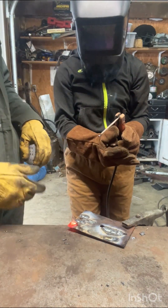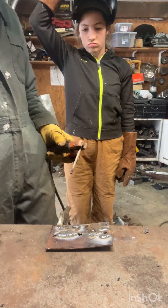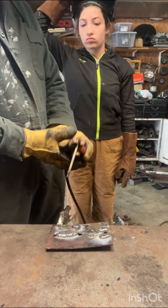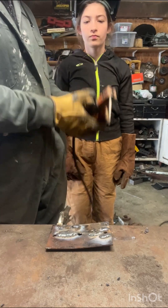Turn off the welder — you've got to be moving it. That's from heat buildup. When you start to weld, you're pushing too much down. You don't really want to be pushing much — you just want to be bringing it back as it's burning, not really pushing down.